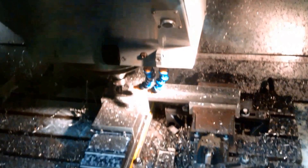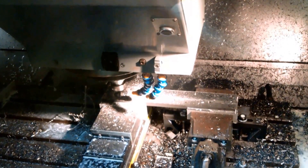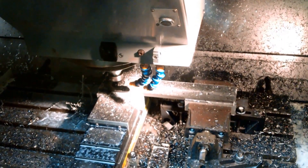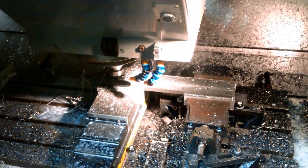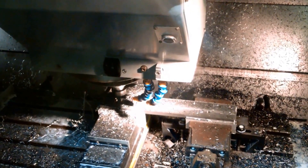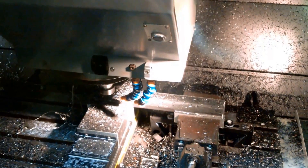There's not that many chips in there. There's always that little squeal on that initial contact as it helices in. We should get some sparks flying as it busts through that hot roll layer - there we go. Now we're taking off. Would be good to have a bit of an air blast in there to blow all that out. I've had quite a few end mills break on me whilst I'm learning all this - they put on a bit of a show when they just about bust: they start glowing red and throwing sparks everywhere.